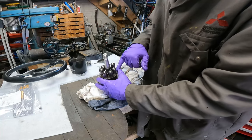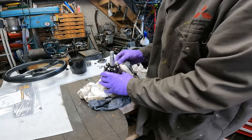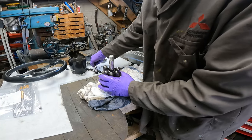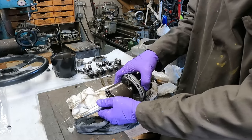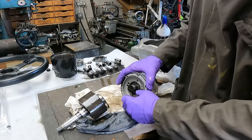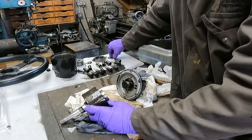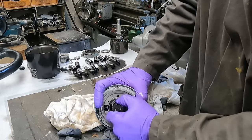I'm going to punch mark on the outside here, and then count these round in clockwise order so I get them back in the same positions — so that will be 12 o'clock, 1 o'clock, etc. All the pistons are taken out now. You've got to lift up the centre rotor and be careful because there are bearings here — note which way that bearing was facing. In here you'll find there's a washer, so keep them in the correct order.